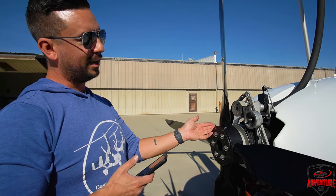Then I'll tell the machine that I've made a change and it'll say, based off of that change, here's the next change to make. So even though the heaviest spot is here, we're going to put a weight here because it's actually 90 degrees before that. Looking at four different spots — 360, 270, 180, and 90 — if the heaviest spot is showing here, it's actually here because of 90 degrees of gyroscopic precession. You don't want to put a weight up here because it'll throw it out of balance. So guys that do wheel balancing at tire shops probably understand this — same kind of theory.